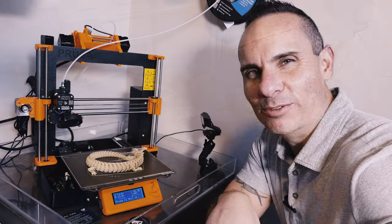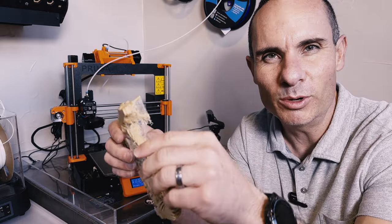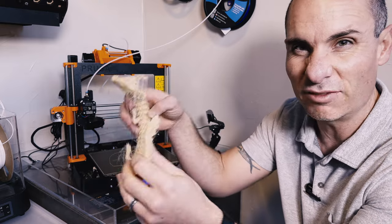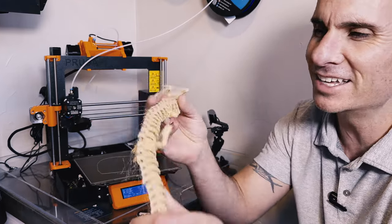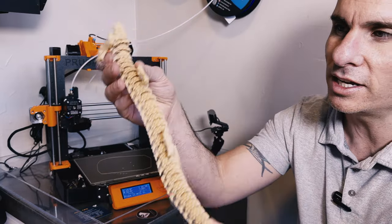That's not exactly what I was hoping for. Let's take a look at what went wrong. You've seen those cool videos of people pulling up their print-in-place things and they just sort of bend and flex really cool right off the print bed. This is a little stiffer. It's loosening up as I move it and manipulate it. You can see there was a ton of stringing.